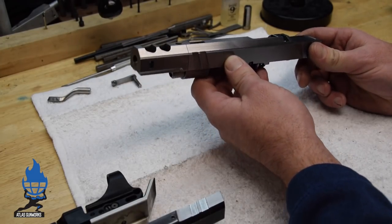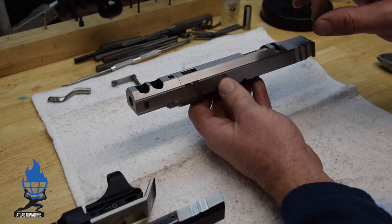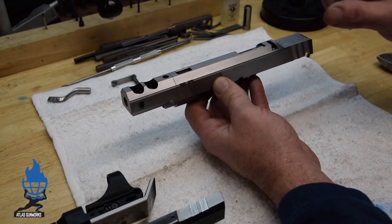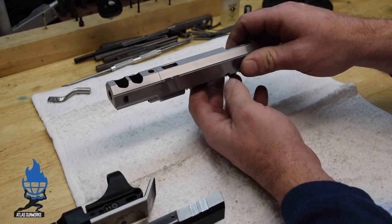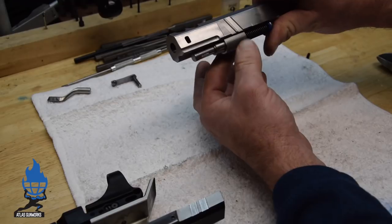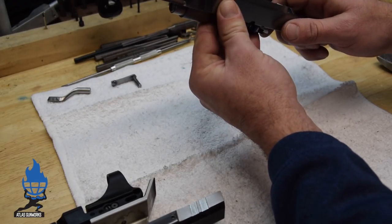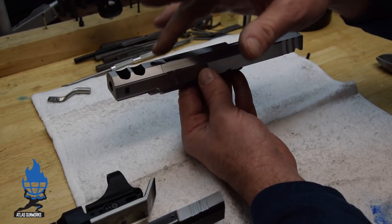A lot of guns return high, and a lot of guns have too much spring and dip after. We've got a different YouTube video about how to address that. On a stroked gun, the slide speed on open guns is a little bit faster, and what we're trying to minimize is the impact when the slide comes back on the frame. We're trying to control that impact so it creates the right amount of upward movement, and then the spring returns the gun to the exact same spot. Your grip pressure, the weight of the gun, the comp — everything is a factor.